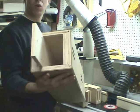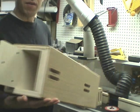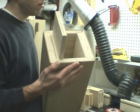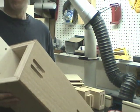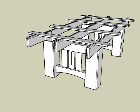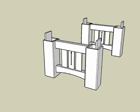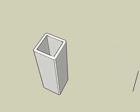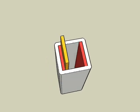The columns are hollow with double wall thickness to receive a mortise for the cross members on one side, and to support the main beams of the pool table on the other side. The columns are constructed using the lock miter bit on the router table, which creates an interlocking joint the full length of the corner. It's a four-sided column that's doubled up on two sides and has an additional vertical support for the cross beams of the pool table.